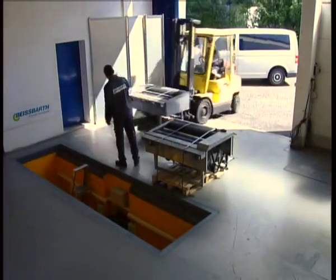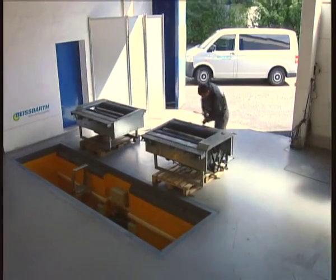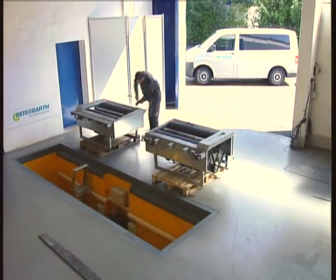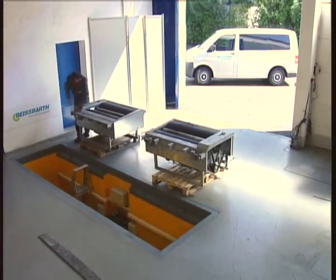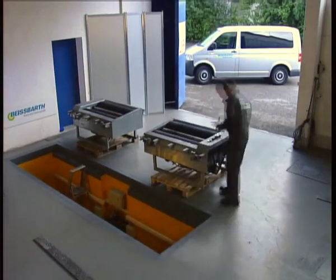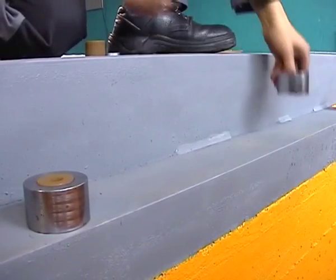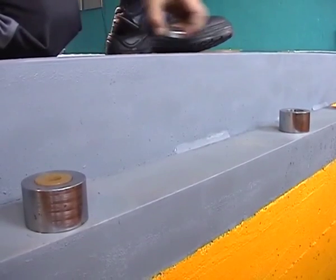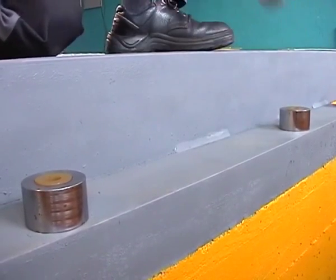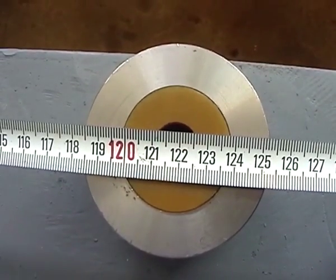The next step is the alignment and installation of the two roller set units. The roller sets will be hung into steel sleeves that are attached to the support for the weighing unit. This makes it possible to add a weighing device subsequently with relatively little input. After having measured the roller sets, the bearing discs and the elastomer cylinders will be placed into the steel sleeves by observing the correct distances between the individual parts, centred and checked so that their horizontal and vertical alignment is correct.